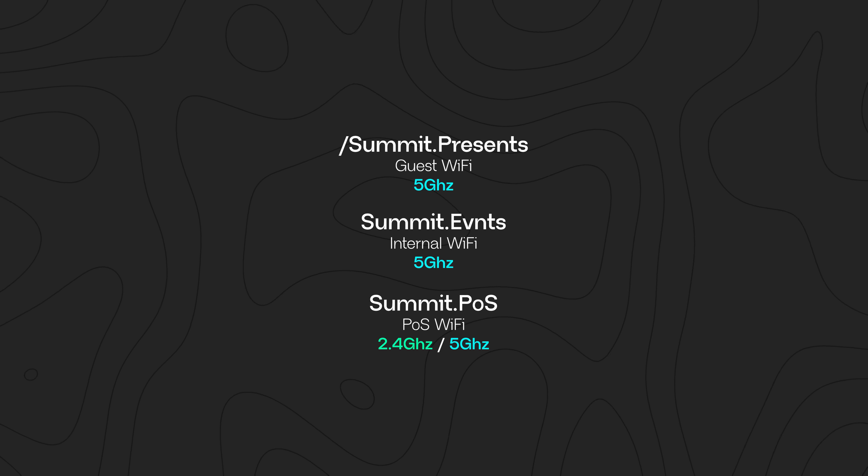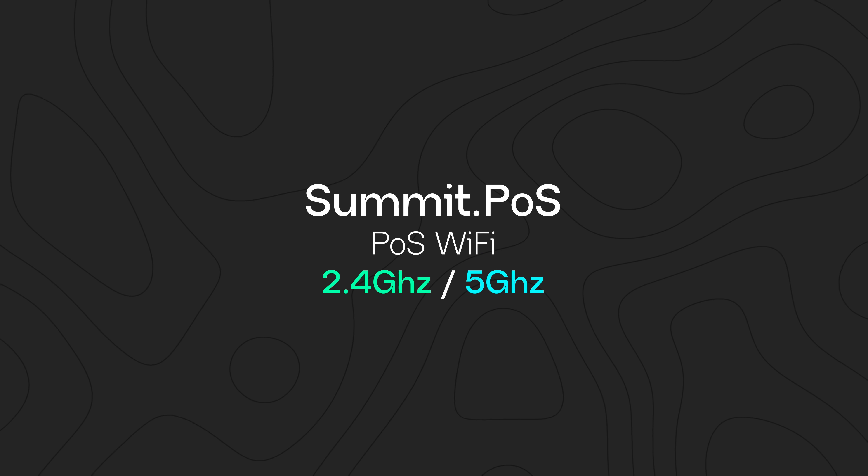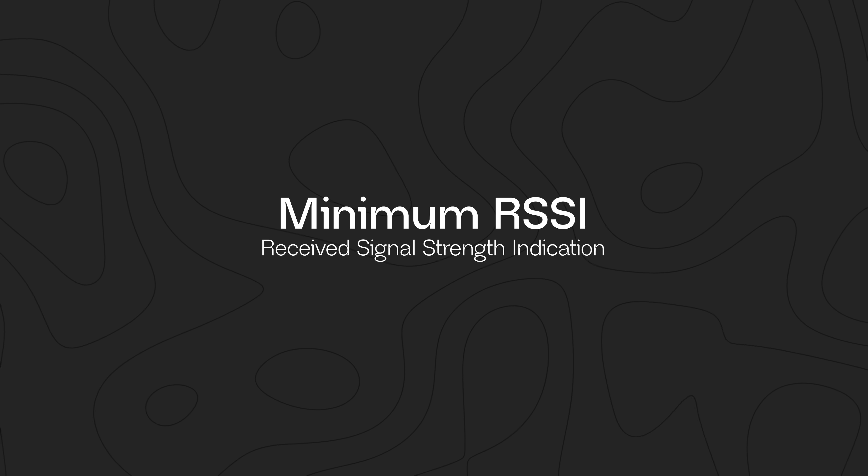For some more technical details, the internal and guest networks were limited to 5 GHz only — I wouldn't recommend using 2.4 GHz at all for a deployment like this. Although some point of sale and card readers can't see 5 GHz, so I had to create a separate 2.4 GHz network just for those specific devices. Minimum RSSI is also a great option for a deployment like this. Inside UniFi, this is configured per access point and basically it will kick off any client that doesn't meet the signal criteria — if they have a weak signal, the access point will just kick them off, and typically it's those weakest clients that have the biggest negative impact on the whole Wi-Fi network. Kicking them off will improve things vastly.